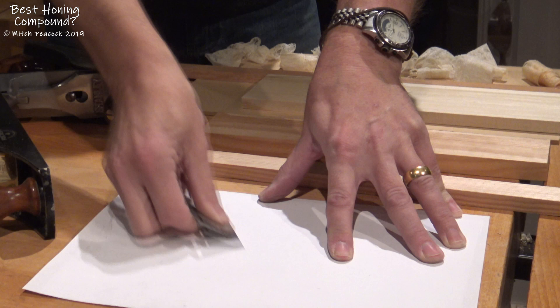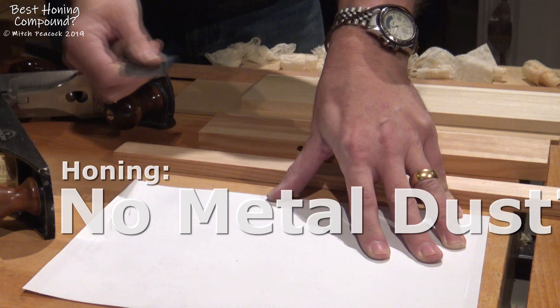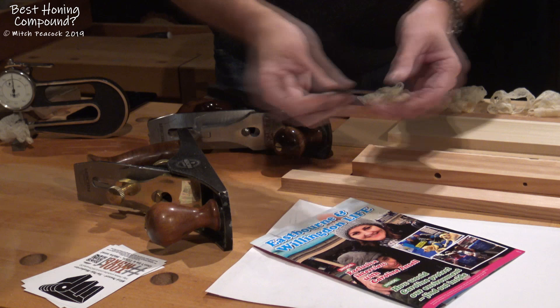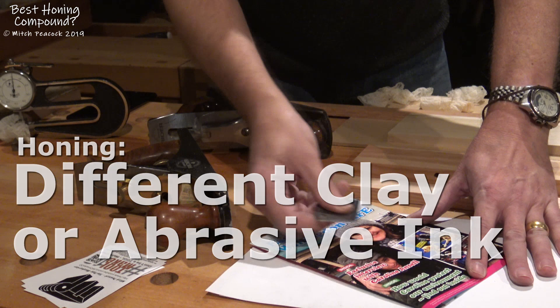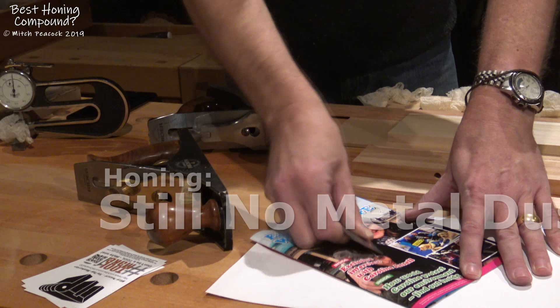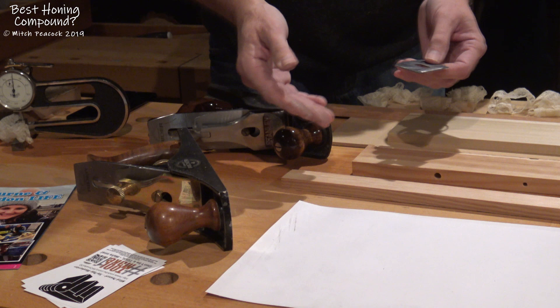So I took my irons and I rubbed them on some copier paper — rubbed and rubbed and kept rubbing — and there was no sign whatsoever of any steel coming off. So the next thought was, well maybe on the actual glossy magazines there is a different type of china clay, or perhaps it is the ink — maybe the ink has got some abrasive compounds in it. So again I rubbed, and no sign whatsoever of any steel coming off. Now it may be that the abrasive is so fine you won't see what's coming off and you'd be there for hours before you could actually see any sign of it happening.